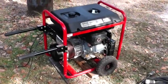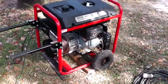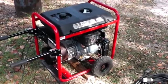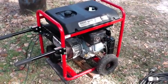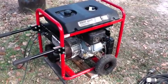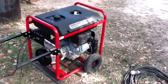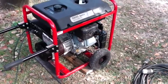I've heard people say all they need is a 3000-watt generator — hey, if that meets your needs, great. The problem people run into is buying a really cheap generator that can only run 10 to 12 hours a day max; run it over that and you'll experience engine failure. I've hooked up transfer switches for people who bought cheap generators and tried to run them continuous for a whole week — they burn up because they're not rated for it. This generator is rated for continuous duty. The only downside is you have to change the oil every 24 hours of run time. I'm working on a filter system so I don't have to change the oil so often.